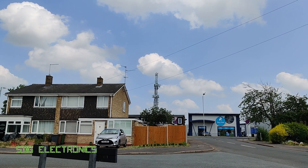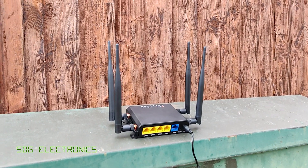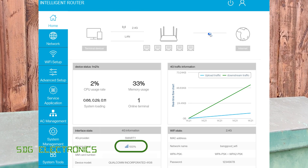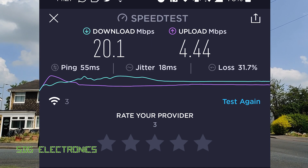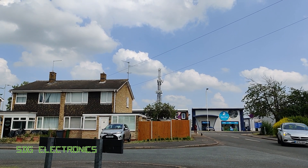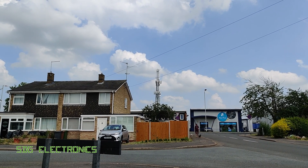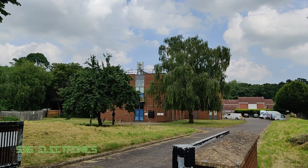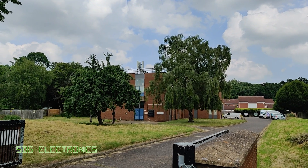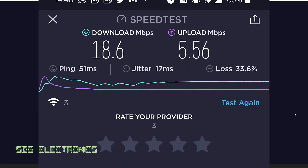I've set up on a random road using the same cell tower I connect to at my house, pointing in the same direction. Running a speed test here, despite being much closer to the tower we're getting exactly the same speeds as before — distance doesn't seem to have made much difference. I suspect it's because it's a weekday during the day with a lot of subscribers on the mast. Trying another mast — a Three transmitter on top of a BT telephone exchange showing 100% signal — and even there the speeds are fairly similar.